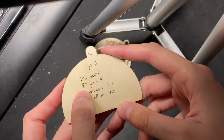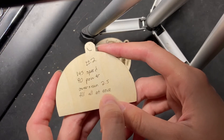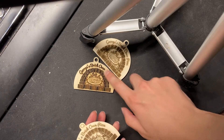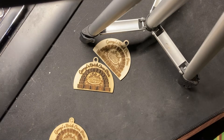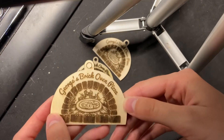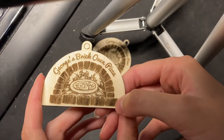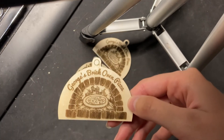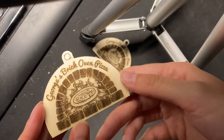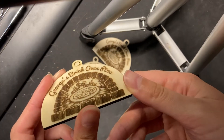So the next thing I tried was the same speed and power, but this time I just turned on 2.5% over scanning and filled all the shapes at once. So instead of doing brick, brick, brick — or in the case of this one where all the letters were individual, which is why they're super dark — it would just go all the way across the entire thing all at once, which gave a much more consistent result. We're not getting that crazy blackening at the edges of any of the items, and I think this just ended up looking a lot better overall.